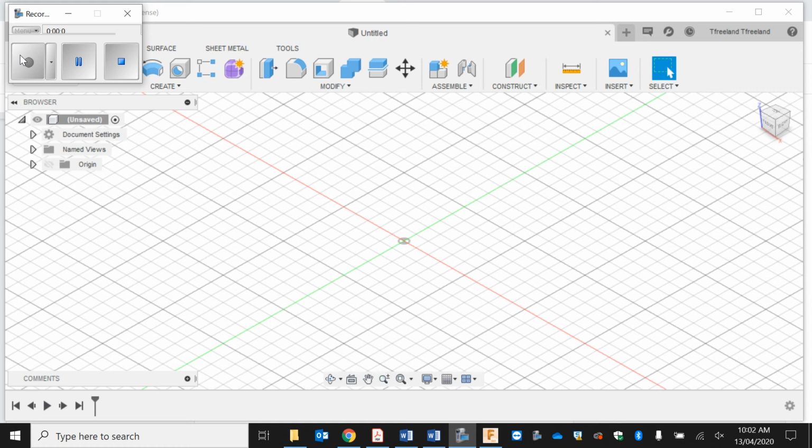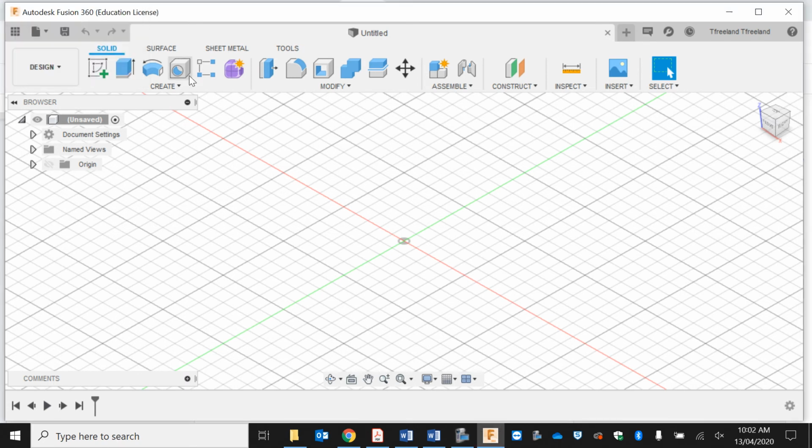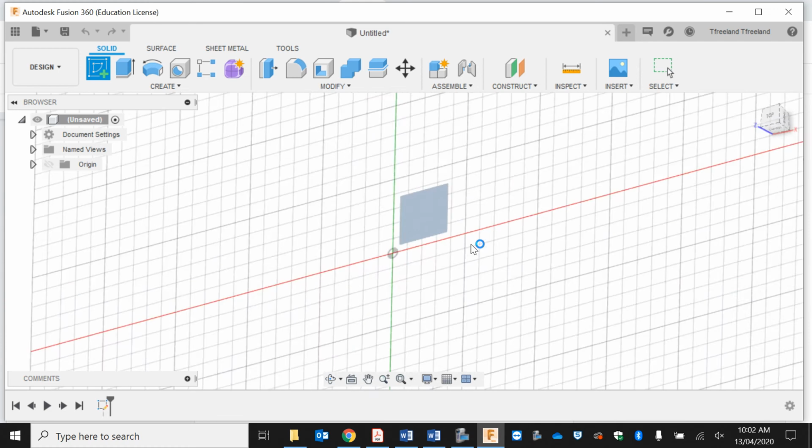What we're going to do now is make something called a mortise and tenon joint. A mortise and tenon joint is a great joint to use when you're building a carcass. It could be for a dining room table, a desk, a bedside table. It's when the side goes into a leg, or predominantly that, and it's an incredibly strong joint. So what we're going to start off by doing is creating the mortise. The mortise is usually the leg.